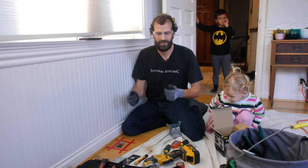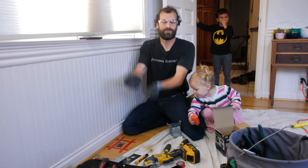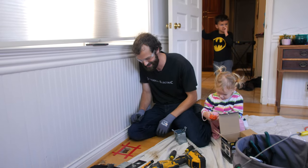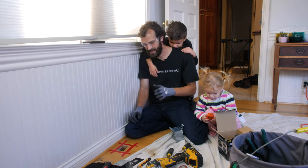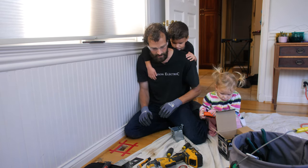And he's just full of gusto. He's so proud of what they've done. He grabs the flooring protection and he just rips it up, and it takes the finish right off the floor in front of the customer. So anytime you're removing an adhesive or tape from any kind of finished surface, take it easy. Go slow.